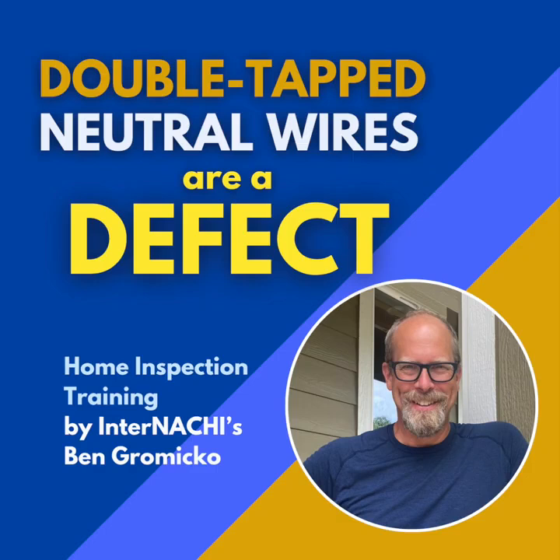The dangers are very real. First off, that shared connection point is just inherently mechanically unstable. Two wires under one screw — it's not solid. This directly leads to loose connections over time, just from normal use. Think about electrical loads fluctuating: you turn on the microwave, the AC kicks on, things cycle. Those wires heat up and cool down, they expand and contract. Two separate wires under one screw might do that at slightly different rates or amounts.